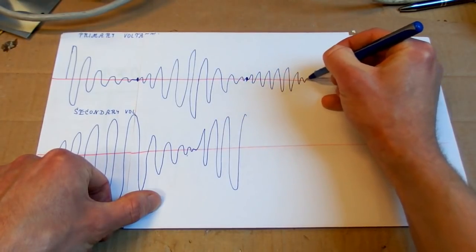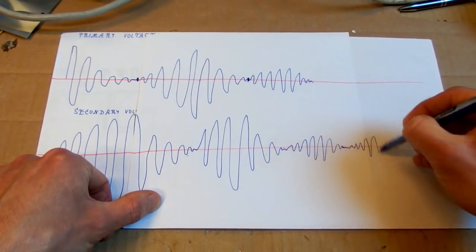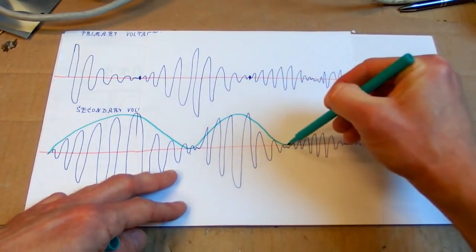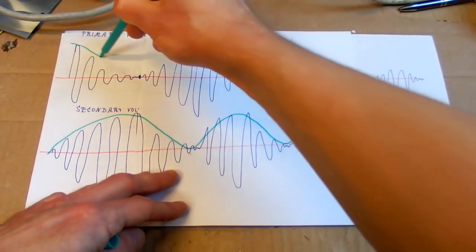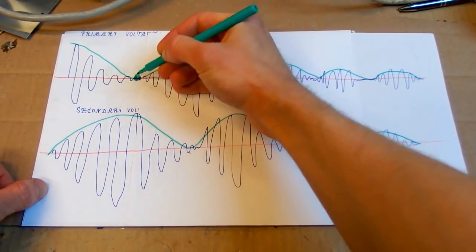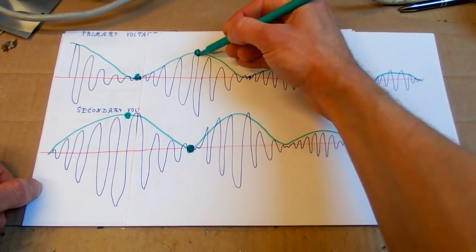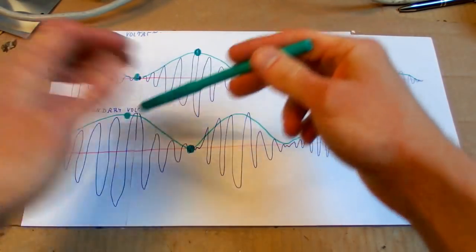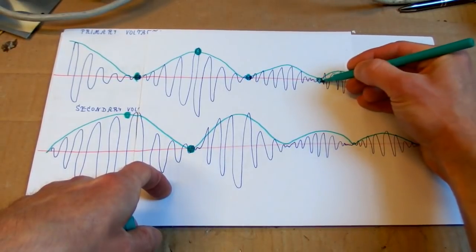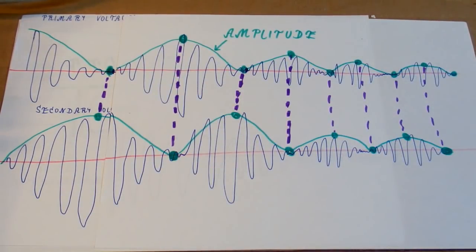As the energy fades out those cycles have lower and lower amplitude. When the primary has the lowest amplitude or zero, the secondary has the highest amplitude, and when the secondary is at zero the primary is on top. It all repeats until the energy fades out or until the spark gap quenches in some notch — it can be the first one, the second one, and so on. Ideally it quenches in the first notch, but if it doesn't it will still run — just with lower efficiency.